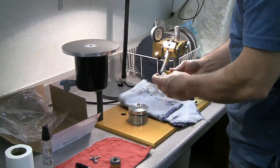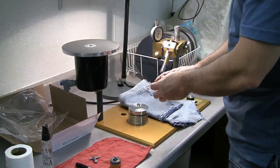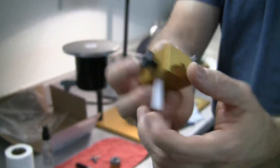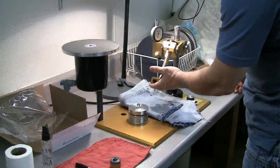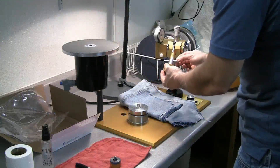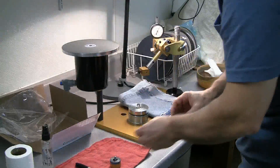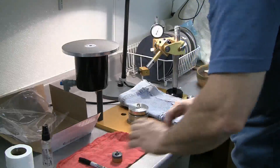To prepare our faceting instrument for the blueprinting process, we're going to take our mast protector off so it's out of the way as well. We're going to set our protractor at 45 degrees because we're going to be using the 45 degree angle adapter. Zero the cheater. Double check that you're on your 96 index and that everything's locked up nice and snugly — don't want any rattles. Take our plastic dop and seat it in our 45 adapter, then seat the 45 adapter in the quill. Snug it nicely and we're just about ready to work.